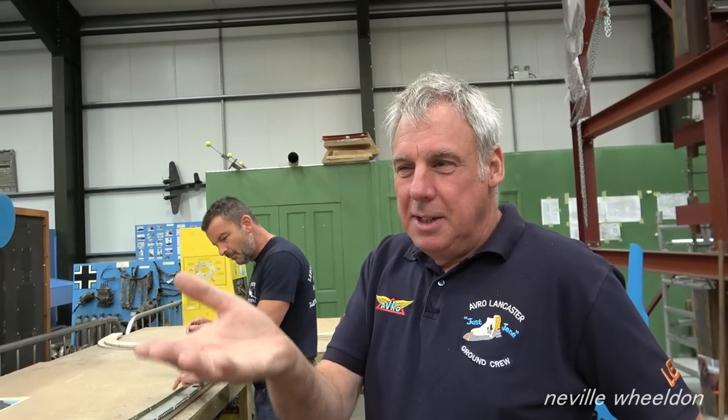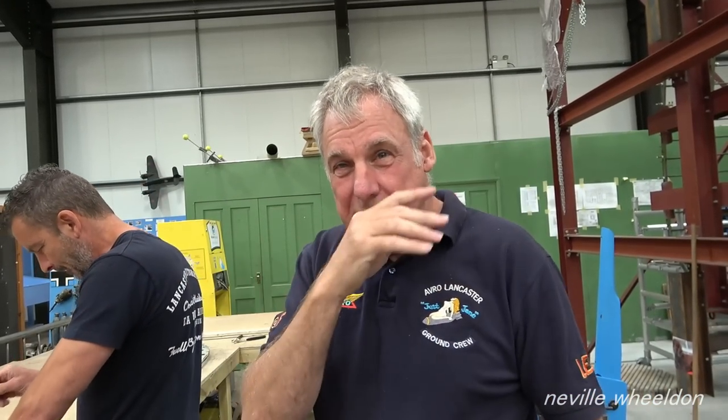The boffins were worried that there was a suction effect, and that all the poppies would just stick on the bomb bay roof. So we did a test drop at Wainfleet of 250,000 poppies. The challenge with the Lancaster bomb bay is all the controls for the engines, the throttles, the ailerons, the rudder and the elevators go through the roof of the bomb bay. There are cables, pulleys, chains for the throttles, for flying controls, all the trim tabs, and they were worried that the poppies could get caught in the chain sprockets and seize all the controls.